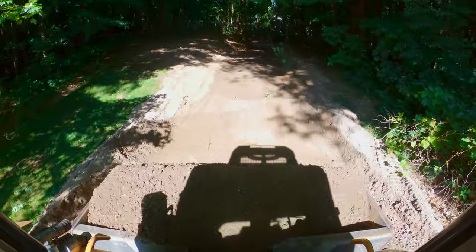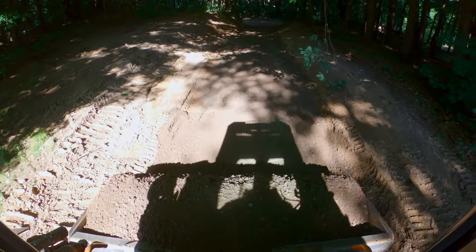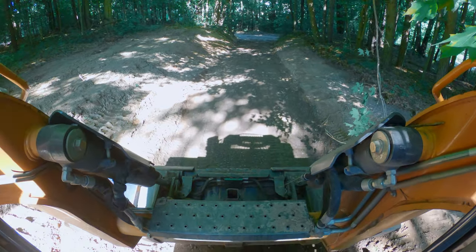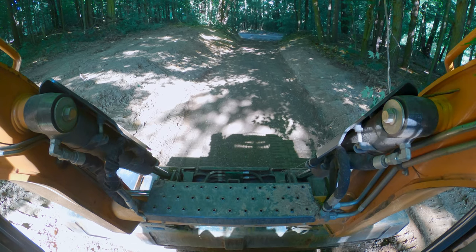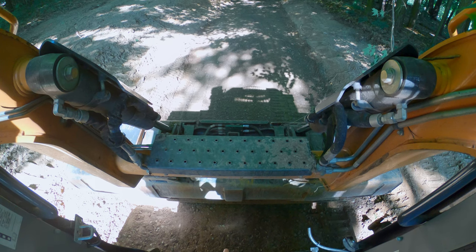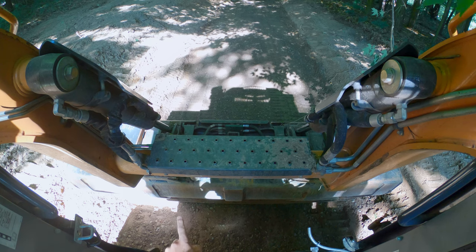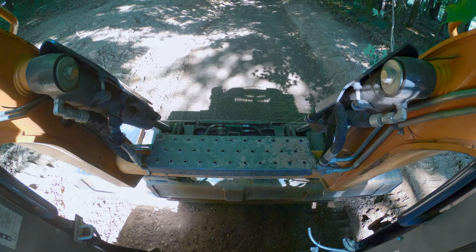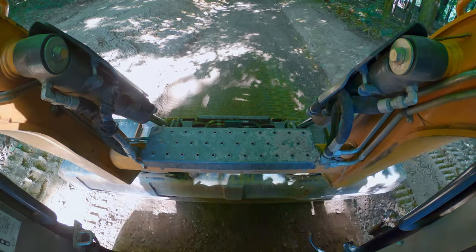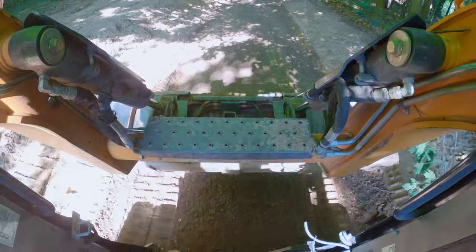There's our bucket of stone. Now because we made ourselves a flat pad to work off of, I can go up here on my flat pad, dump out in front of it, and when I do my initial spread, you're going to notice that the cutting edge of my bucket is just resting at the grade that I made with my pad. Now as I drive forward, I just keep my bucket at that level, making little adjustments as the grade changes.